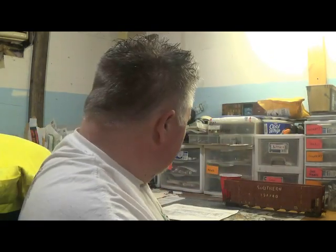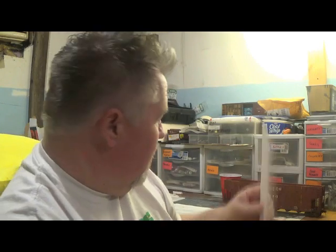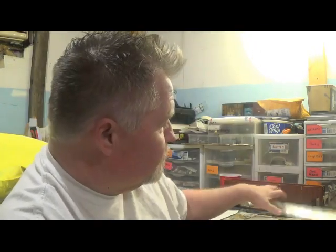I have already put this one together, but I'm going to explain it to you. I've got some still pictures that will show the process as well. To begin with, what you're going to need is to go to Walmart or whatever big box store and get some of the large for-sale signs. You can get one car out of one sign, but I buy them five at a time because I use so much styrene — a lot cheaper than ordering from styrene distributors, and it's the same stuff. You're also going to need some balsa wood — you can get it at Hobby Lobby or order off eBay. And you're going to need some Evergreen six-by-six strips, product number 8606. That will get you started.